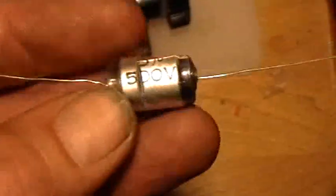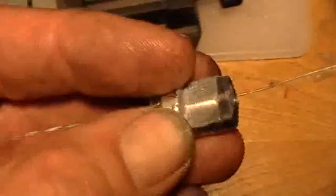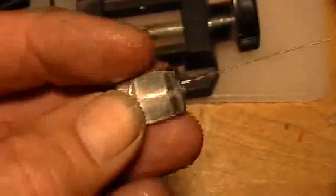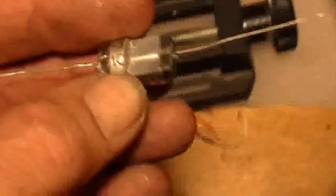One of the features of a capacitor is that it will not pass DC as long as you're below its rated level — a capacitor simply won't pass DC. But because of the way it stores energy in an electric field, it winds up being able to pass AC depending on the frequency. For every given capacitance there's a frequency at which the capacitor will pass the AC power almost without interference — it's almost like it's not even there.